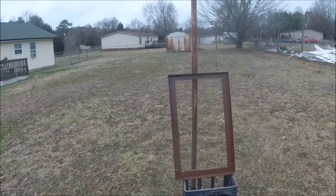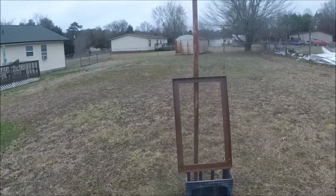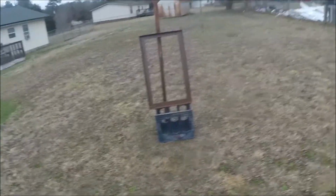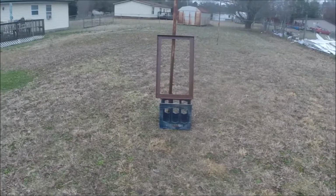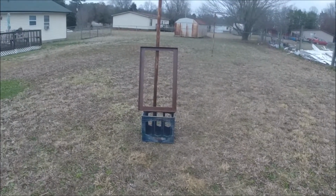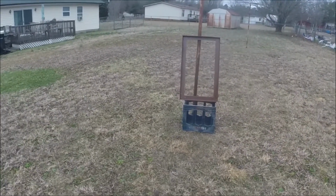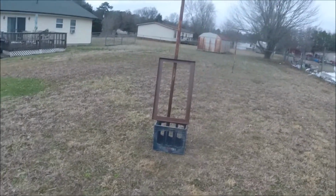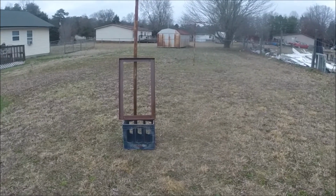It kind of, trying to get a good word for it. The casters are just not big enough or sturdy enough the way they're mounted, tack welded to the legs. The saw base is plenty strong enough. So what I did is I made this base that should set down inside the legs. I'm going to put 4 bigger casters on it. I went to Harbor Freight and got them, and I'm bolting these on so I don't put any heat to the casters, so you see the bolt holes in it. Then I'm going to cut a piece of plywood and set it down in it, so it also gives me a little shelf. I'll probably bring it in the shop and let it finish drying so I might could hit it with some paint later.